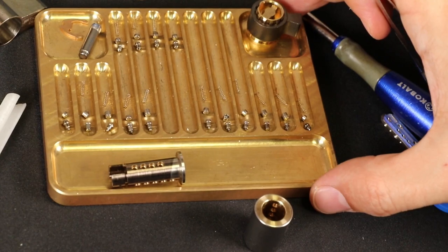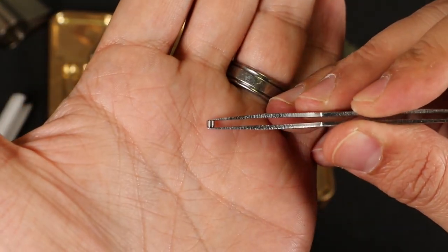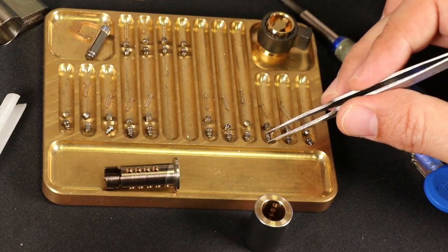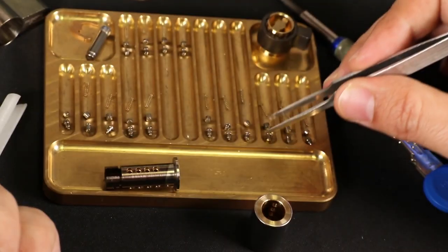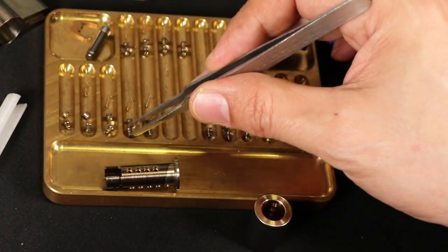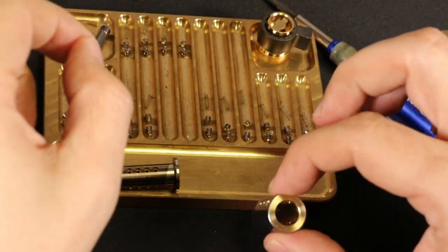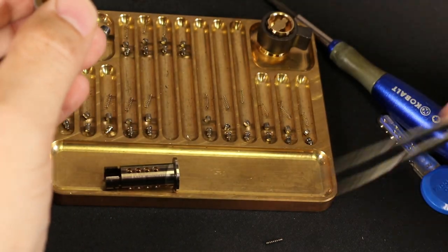There's all of our components. For the drivers you can maybe see how it steps down a little bit at the bottom — that's why you have to pick those twice. These are the fat key pins. And like I was saying, they have a thin lip up top so you could over-set these on the key pins. That's the Dormacaba Gemini Plus.